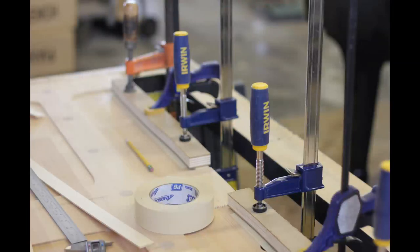C: Kawai Keybeds. Kawai pianos have a keybed cutout or recessed areas. The best way to fix this is to build up the area for the new bead so there is a level contact surface. Glue 1-inch shim stock of the appropriate thickness in the two cutout areas and sand flat after drying.